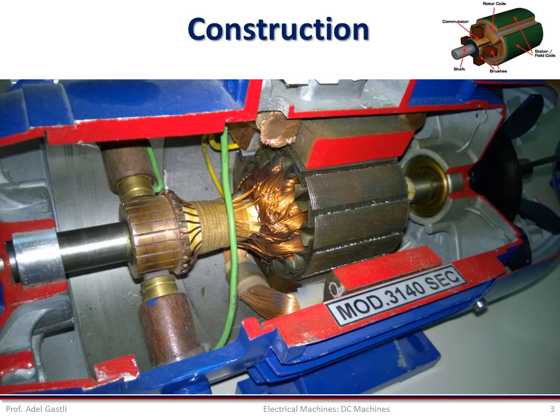This photo shows the construction of a DC machine in three dimensions, with a longitudinal cut showing the inside part of the machine. The main parts are the frame or yoke, which is generally a cylindrical shape. It acts as a cover frame of the machine and carries the magnetic flux produced by the field windings on the poles. Since the field is stationary, there is usually no need to use laminated yoke for normal machines. In small machines, cast iron yokes are used because they are cheap, but the yoke of large machines is made of fabricated steel due to its high permeability.